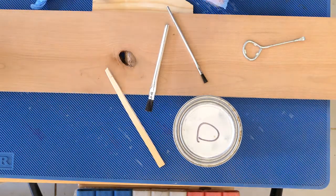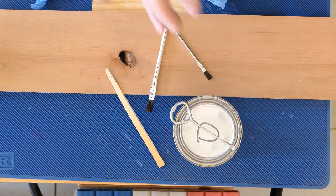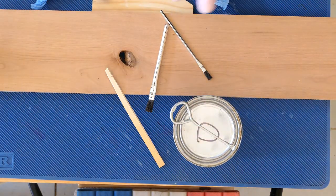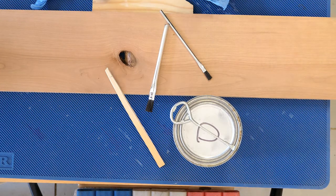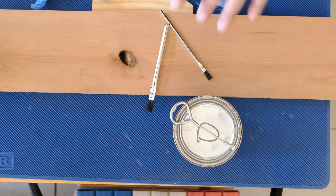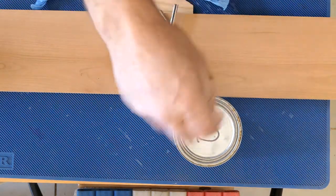While I use it. Now, with the polyurethane, after you open it up, first of all, you never want to shake polyurethane. That just puts bubbles in it. That's not necessary. But with the polyurethane, what you want to do once you open it is, the oil base is a lot worse than the water. I just want to stir it to make sure it's nice and evenly stirred.